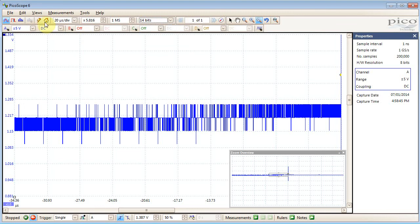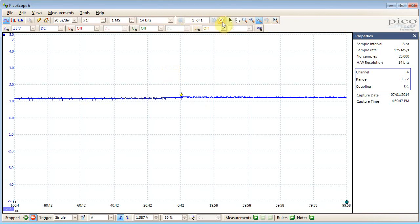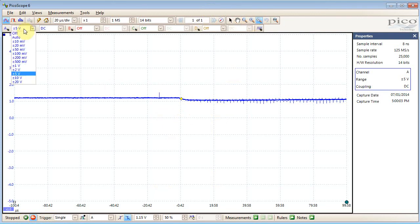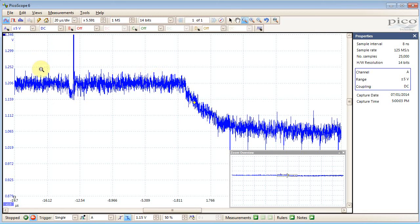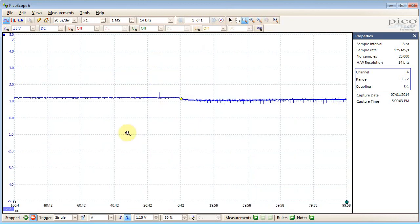If you have the 5000 series then you can just increase the actual bit resolution that you're capturing at — that also solves the issue completely. Going back to the original problem: here's when we go from full load to no load, and if we play around with the triggering we should be able to get the other way — from no load to full load, there you go. Here I'm using a really wide plus/minus 5 volts, which the 8-bit resolution would have been okay with if I didn't need such a wide input range. If I only needed the 500 millivolt or 100 millivolt range maybe that would have been fine, but if I want to capture all the detail of that spike at the output going up to 5 volts in the same capture, then having the ability to switch the bits instead is very convenient.